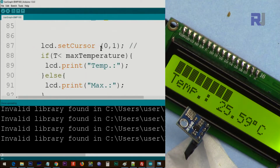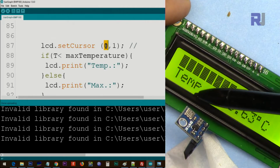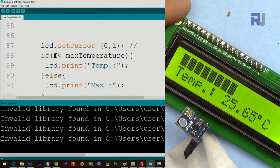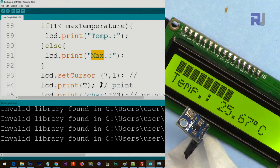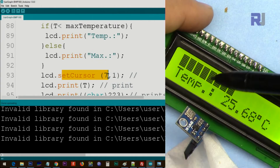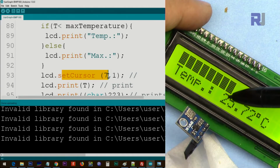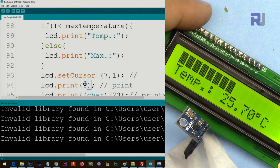And then we set the cursor at line 1, cursor character 0, line 1. We jump here, and again we check if the maximum temperature is bigger than temperature, then we print temp. Else, we print the word max here. And then we set the cursor to go to character 7. You see here, this is 0, 1, 2, 3, 4, 5, 6, 7. At 7, line 1, we print the temperature, which is this temperature,